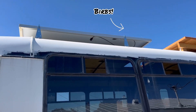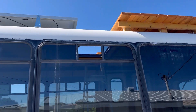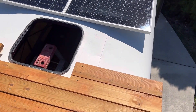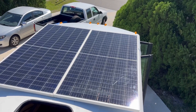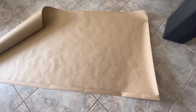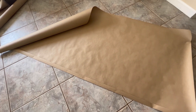Here's what the roof looks like so far. Now it's time to get to work building a wind fairing to keep the wind from lifting the panels when we're driving down the road. I borrowed a roll of craft paper from my friend Mark and used it to make a template. I cut an 8-foot strip to go all the way across the bus and folded down a flap to attach to the solar panels.